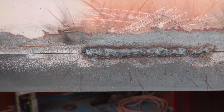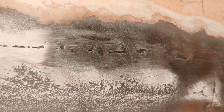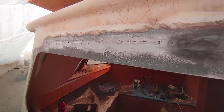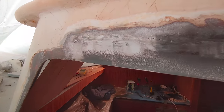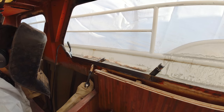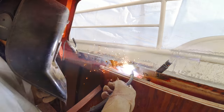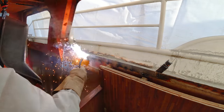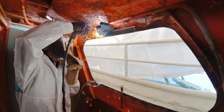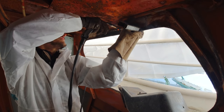I know I probably shouldn't, but I'm going to show you the result after I ground away my welds. The darker areas that seem like gaps on the left and right of the weld are actually just areas that are deeper than the surrounding material, so the angle grinder couldn't reach them. But it seems that the metal is in fact properly bonded together, at least for the most part. After my first couple of days working with a MIG welder, I find it much easier than a stick welder — mainly because the distance between the handle and the steel doesn't change constantly like with a stick welder, making it easier to develop the proper movements. Still, it does require a lot of practice, and the little welding work I have here is by far not sufficient to get that experience. Nevertheless, I got the job done and I'm pretty happy with the result.